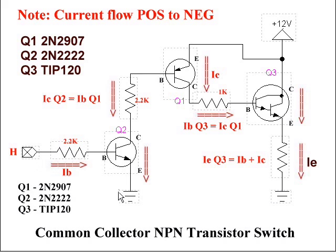A high on the input of Q2 switches Q2 on. The collector-emitter current of Q2 is the same thing as IB of Q1, creating an emitter-base current that switches on Q1 emitter to collector. So IC of Q1 is in reality IB of Q3, which switches Q3 on. This load down here represents a heavy motor or whatever you've got. For all practical purposes, IE is IC plus the little bit of current from IB, and we have a huge current flowing from Q3 collector to emitter.